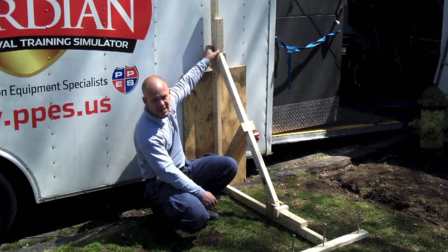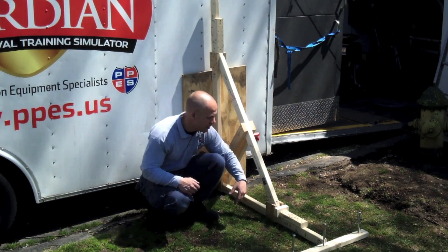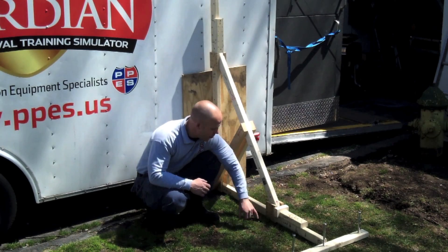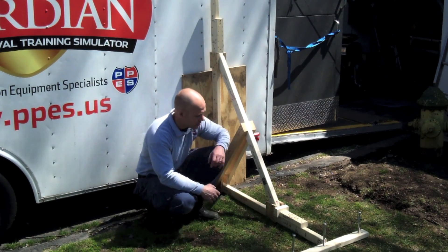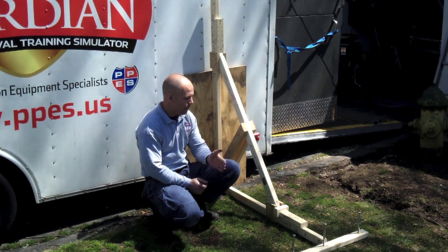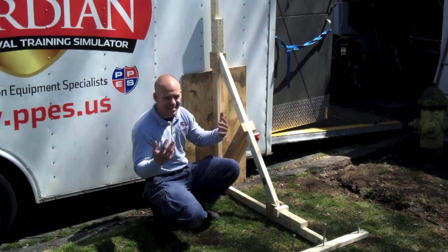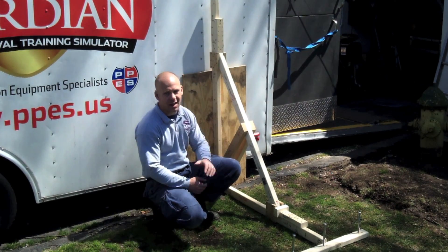It's going to give us that force we want up against that wall to give it the added support. The cleat's up here — it's a 24-inch 2x4 cleat, the same down here — 16D nails into the lumber, 8Ds into the gussets. It's pretty straightforward and simple. The concept of capturing load is the same, it's just done a little bit different.